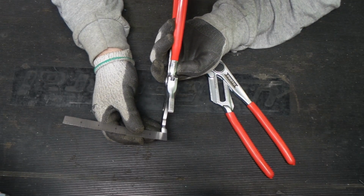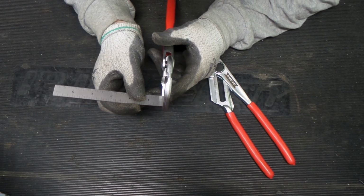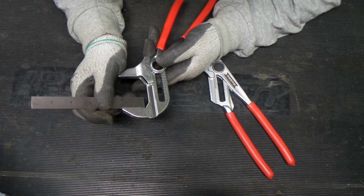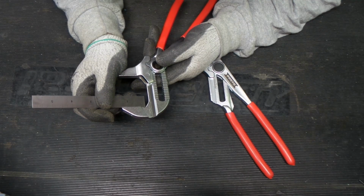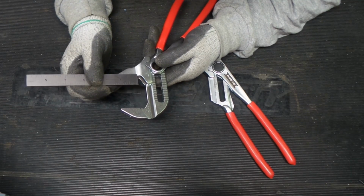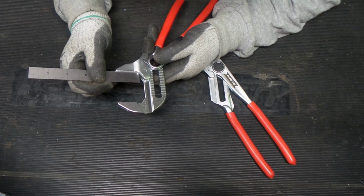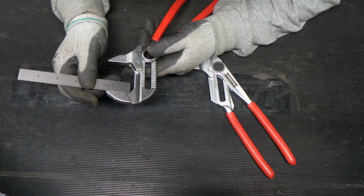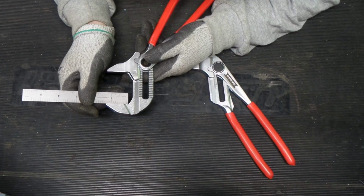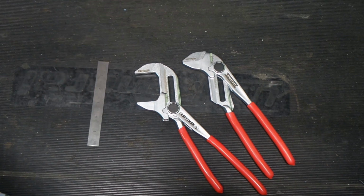And the fixed jaw is right on 5/16. The movable jaw is also on 5/16. The fixed jaw can go about 1 3/8 inches straight, and obviously you could get back into here further, but we always measure the straight surface. And the movable jaw, you can get that 1 3/8 inches out of it also. So let's go 1 5/16 inches. I'm right in between there. So 1 5/16 inches for our dimension and 5/16 inches.